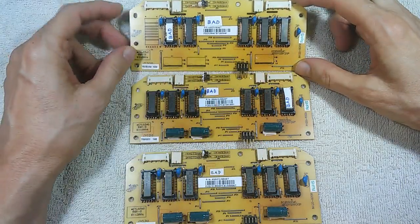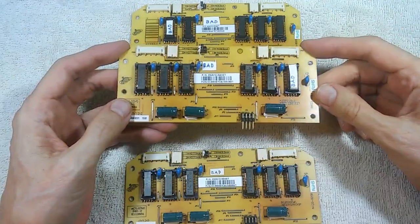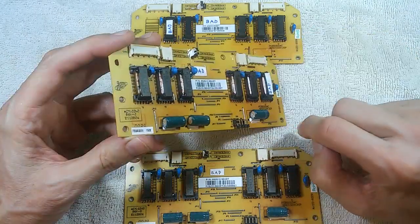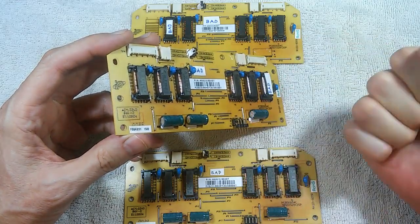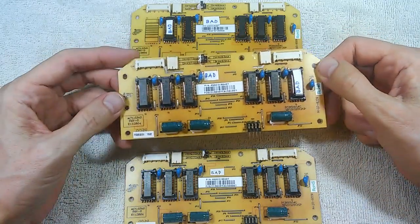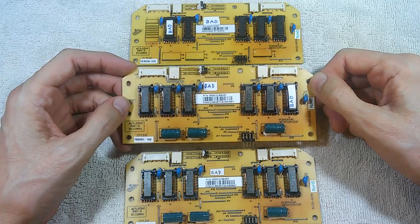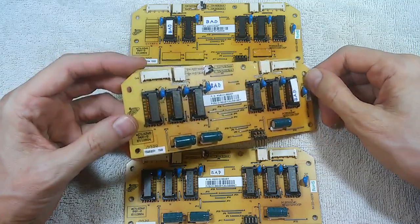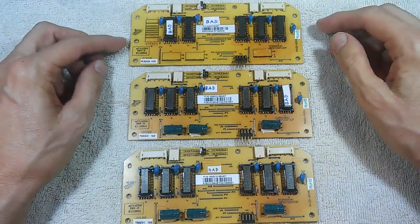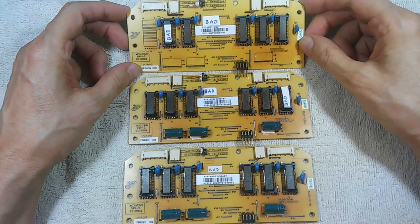Incidentally, I'll also remove those capacitors, because that's another thing which frequently fails in old electronics. Any capacitor made between 1999 and 2007 will have a much higher probability of failure. When they fail, typically the top of the capacitor will dome up — that's because pressure is building up inside. This is part of a historical event called the capacitor plague. In this case the capacitors are all good — no swelling. If you have consumer electronics older than 2008 that has failed, the first thing you should look at are the electrolytic capacitors. However, in this case, we know it's the transformers.